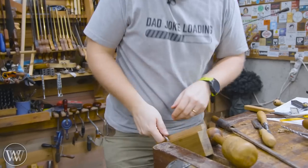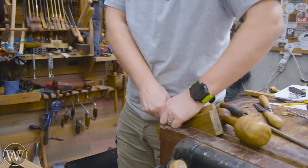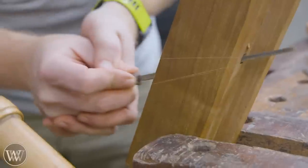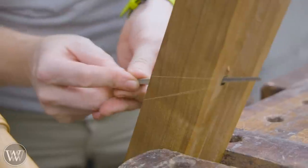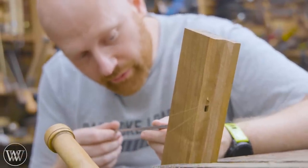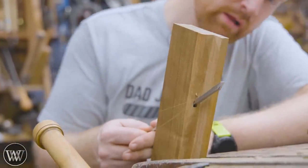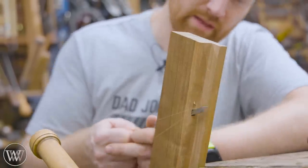You're just giving yourself a smooth edge. I can put the chisel in there and use the side of the chisel as a straight edge, making sure it touches the rectangle on the top as well as the rectangle on the bottom. If it's rocking in the middle, you need to take out a little more material. If you don't have floats, files work really well — finding one small enough to fit in there is sometimes the difficulty.